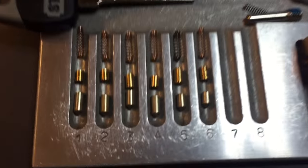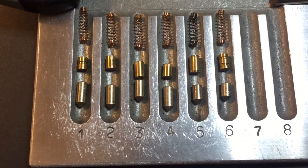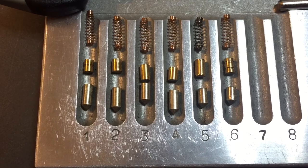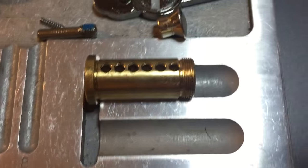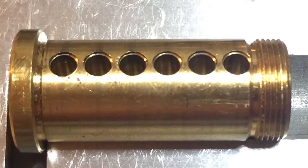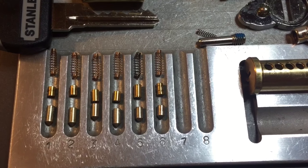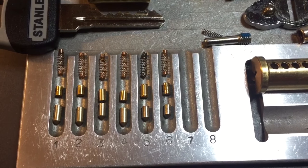Let's take a close look at these pins. You can see all standard key pins in nickel silver. In number one we have a single serration driver pin, number six a double serration, number five a modified standard — that's probably our anti-bump pin stack with that stronger steel spring — and then three standard driver pins in slots two, three, and four. Moving over to the core, counter milling in all six slots is a high-end feature that makes all the pins pick just a little bit harder. Very nice features overall in this Stanley model 8820. If you have any questions or comments please put them below, please subscribe, and as always have a nice day.